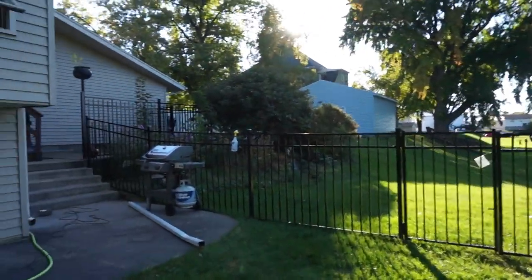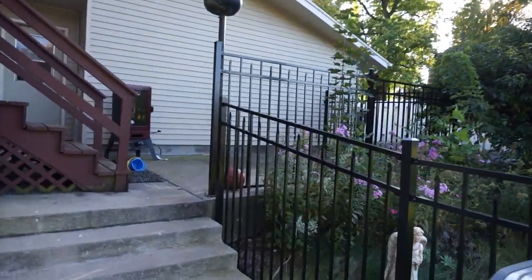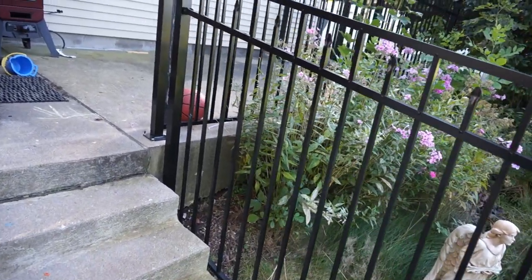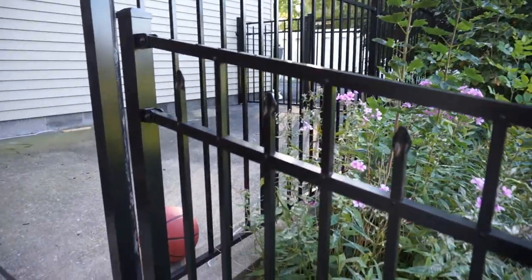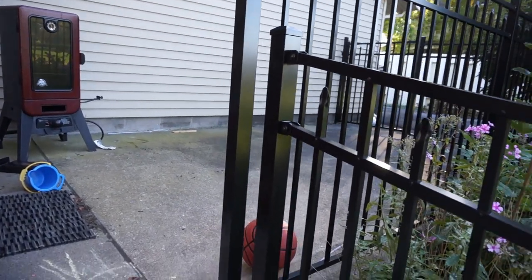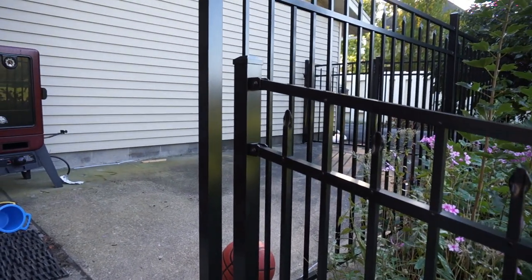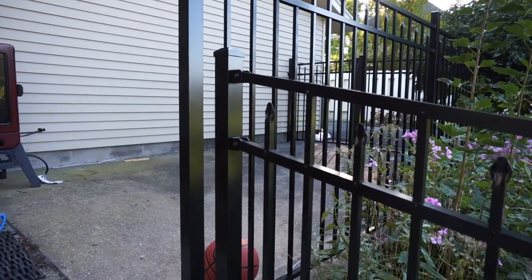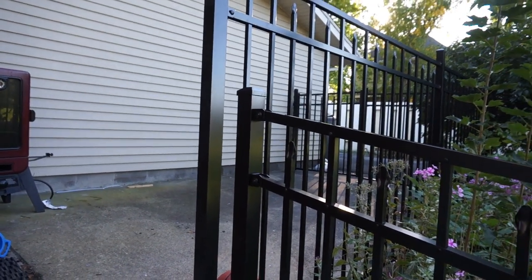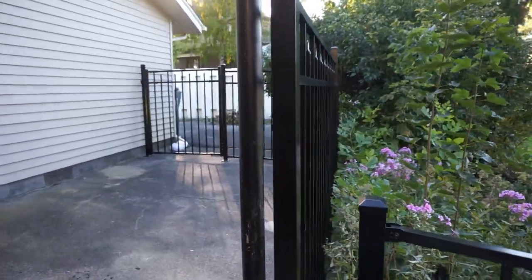Here's an interesting situation — this length of fence is replacing a banister that was here and had rotted out. A person can grab this for support, but the problem is I contacted Wambam and said I've got this fence post that I want to firm up. They said I could dig around it and put in some concrete — 'some' was kind of in parentheses. They said a minimum amount. I'm worried that if I go that route it could cause potential frost heaving issues, since the instructions had special digging requirements for northern climates to prevent heaving.